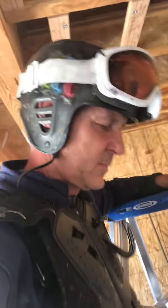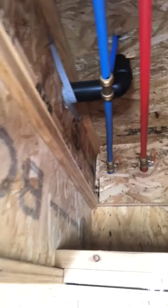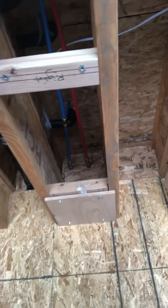I guess I'm going to redo it. But that's a plumbing DWV — drain, waste, vent — fitting. We talked about adding volume to the floor joists in a non-conditioned space like a garage so you can insulate. That shows you a series of venting with a 22-degree slope for a tub clean out, associated vent, a toilet associated vent, vanity associated vent, and encouragement to build an access panel big enough to get your head and shoulders in. We hope this helps you.